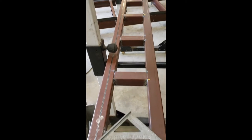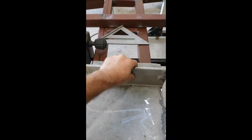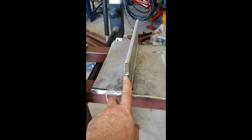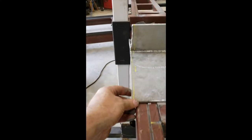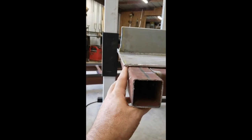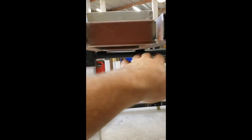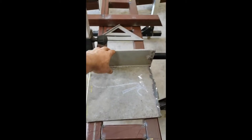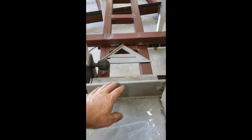We're going to keep moving on with the actual adjustment part for the cutting heads. I've got a piece of scrap quarter-inch plate that I already had, cut off from another project, and it's already got this angle iron welded on it. I've given myself enough space so I can sit this on here, then put in some little paper shims just to give it a little bit of space. I've got some little flat bar cut from quarter-inch that's going to get welded on here, and then obviously I've got to put one that goes all the way across. It's going to have just enough room so that this whole assembly will slide back and forth, and that will give me room to put my tensioner over here pushing back on it to keep the belt nice and tight.